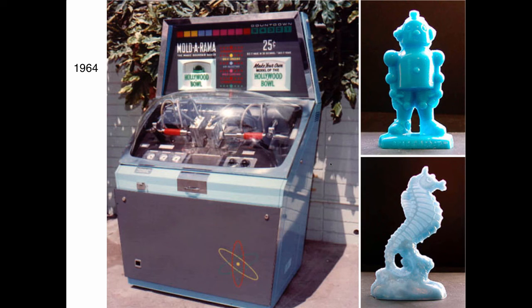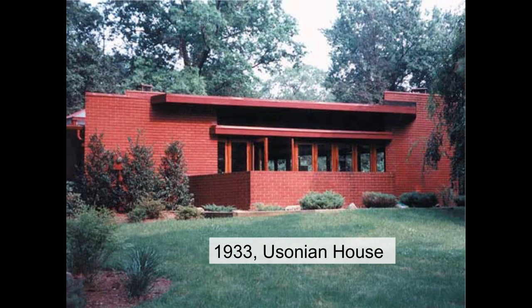So polyethylene goes on to play this role in radiant heat for a while because they try to use it instead of the pipes that they were using at the time. But they find out that polyethylene will get mushy. It's a thermoplastic. As you heat it up, it's not going to stay stiff. It's going to get mushy, and that's not good if your controls on your boilers are not that stable. So polyethylene kind of sits in the background and becomes a plastic meant for other things other than heating. But it will show up again.